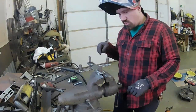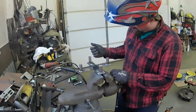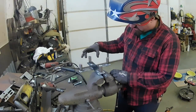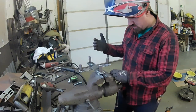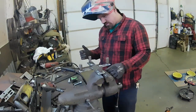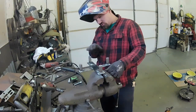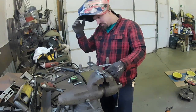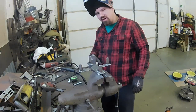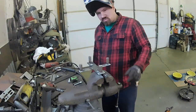In case you're wondering, there's some galvanized coating on this pipe — you can see the steam rising up, and some of that's fumes. You've got to be careful when you're welding any kind of galvanized not to breathe much of it, because it's poisonous and it will give you a headache and make you kind of sick sometimes. I've caught a few whiffs of it, but I'm done welding so I'm going to stay away until they cool down.